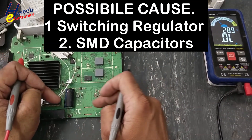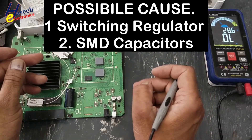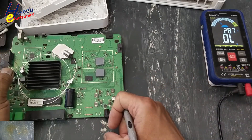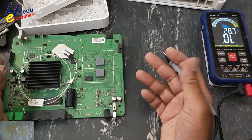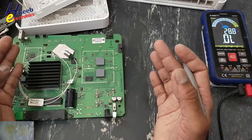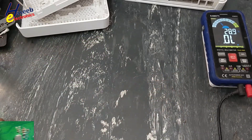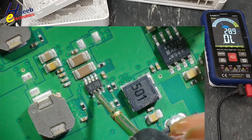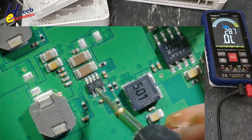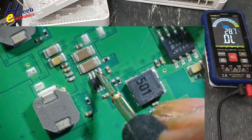All regulator input sides are short circuited. Might be any one regulator is making a short circuit that is providing a short circuit link on the DC rail. We can inject high current supply to find the problem, but when there is a microcontroller or microprocessor, it is best to avoid high current. These regulators — AEU — are basically the MP2233DIC: an 8-pin regulator with ground pin, switching pin, and positive supply pin. We will check these three pins.